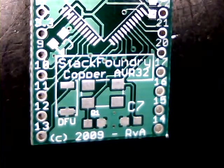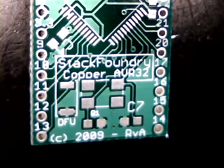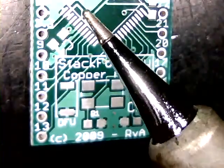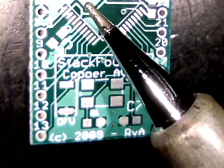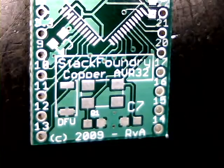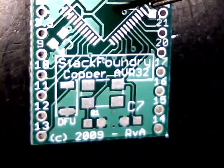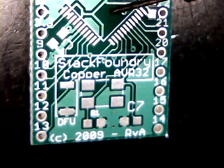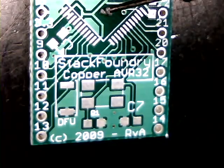First of all, I'm going to show you the tools we're using. Of course, we have a soldering iron here. I'm soldering at about 325 degrees Celsius, or about 620 Fahrenheit. This is a very nice temperature for this solder paste. It's a leaded solder paste with a quite fine needle. We have a paste dispenser, and if we press the foot pedal, we hopefully have paste coming out — there we go. In case you have a mess, simply clean it with a little bit of paper.